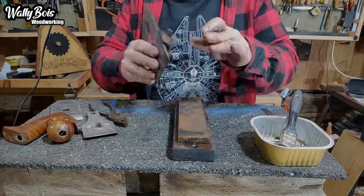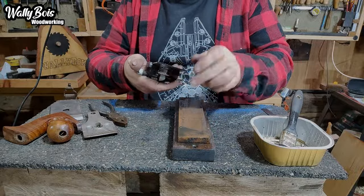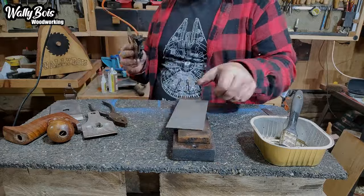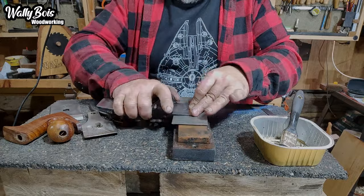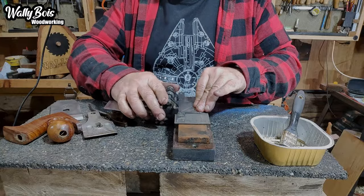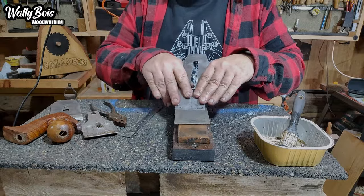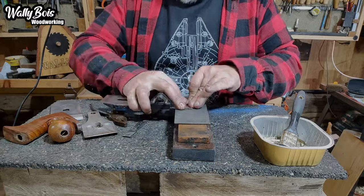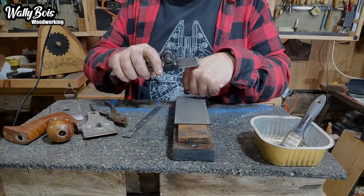This particular stone is 1200 grit on one side and 600 grit on the other — coarse and fine. This is basically a fresh grind. Now I'm using a 3000 grit diamond sharpener to polish the back. I put a steel rule down when flattening the back — this ensures the back of the plane iron is nick-free. There's no nicks in the back of the plane iron, and that's called the Charlesworth method. It works. A little bit more honing using the 3000 grit diamond sharpener — this is only a cheap one that came from Temu.